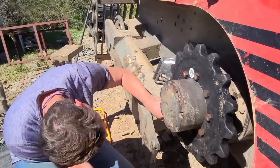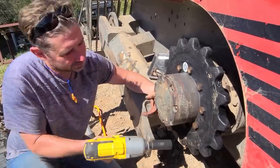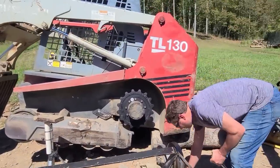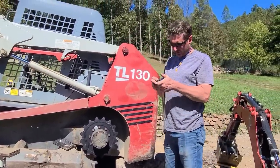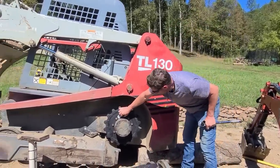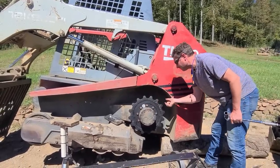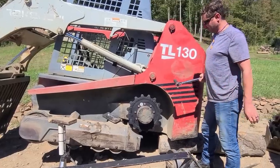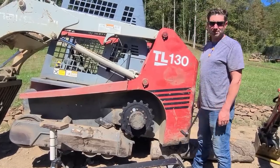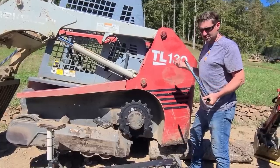I've got to go look up the torque and the schedule here. Didn't get the one at 4 o'clock. This one? There you go. I didn't know that's how you figured out the torque specs. How do you figure them out? I knew the head diameter. The operator's manual tells you the head diameter of the bolt or the coarse thread measurement. You either know one or the other, and it'll tell you the proper torque specs. This one is a 24 millimeter head. I think it was a 16 millimeter thread diameter. And it tells you 156 foot-pounds.